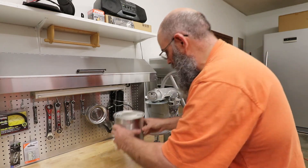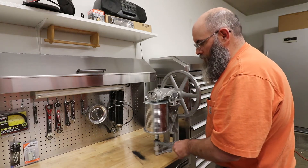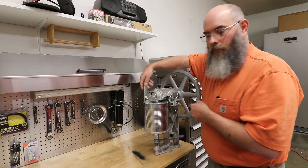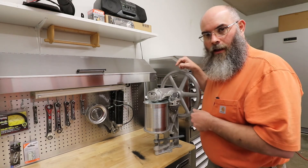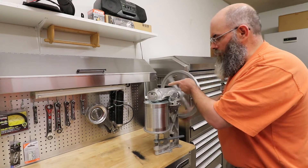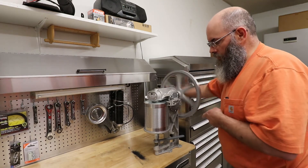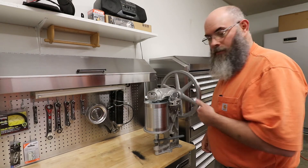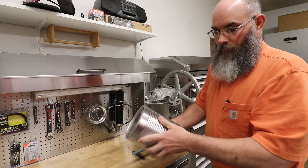The lid goes on — it's pretty self-centering. Raise it up into place, and then what happens is you turn it. There are dies on either arm: they come in one and then the other, and they have a slightly different profile. One starts folding the lid down, and then the other one actually crimps it and seals it up good. You can see the first one come in and back out, then this one comes in to finish the sealing. When that one backs away, you're done — pop it down. That's sealed up tight.